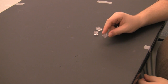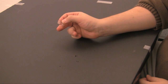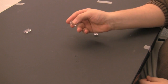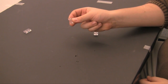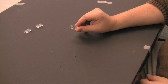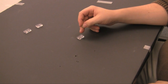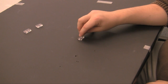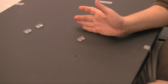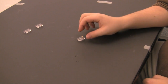There are three types of belt clamp in the Fab-at-Home system. One has long grooves on the side — this is a sliding belt clamp. One has small holes on the side and is a through-hole belt clamp. The large hole on the side is for threaded inserts and will take 2.5mm threaded inserts. It does not matter which direction the insert comes in from, but it should be consistent. When placing the insert in, it will bow out to the side — that is fine. You don't need to worry about re-cutting a laser cut part that bows out from the insert.